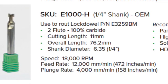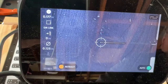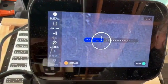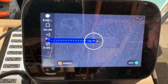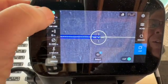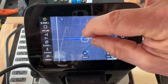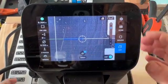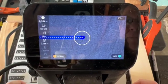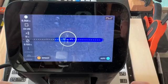You'd want the specific Lok-Dowel bit to make these cuts. You do the short cut first — it's 4.5mm deep. Then you have to make sure you select the second cut, set it at 9mm deep, and then go the other way. When it comes right down to it, that's all there is to it with the Shaper: you just line it up to that reticle, stow it, and hit the cut button. Do it over and over again until all of the cuts are done.